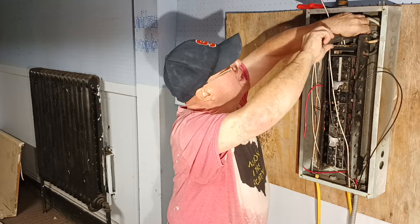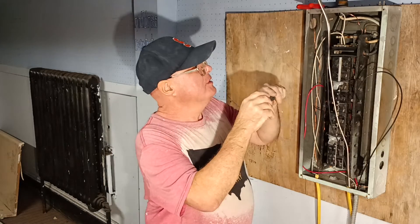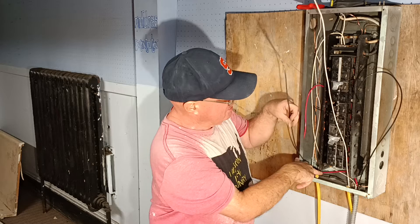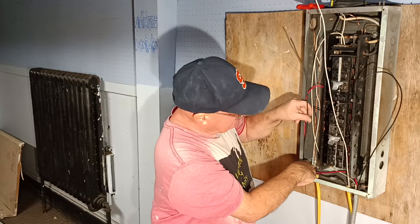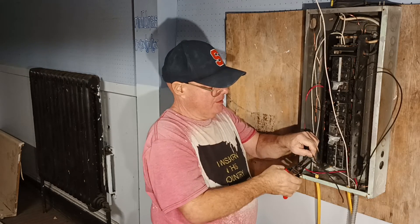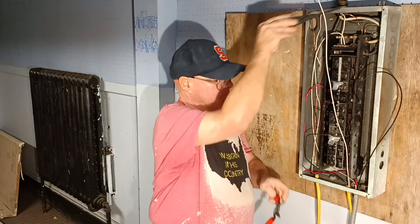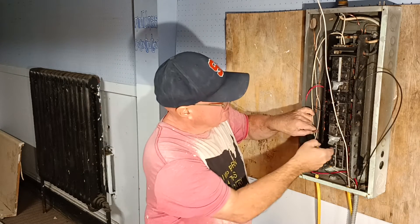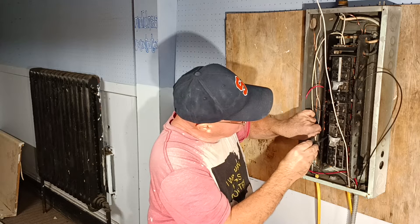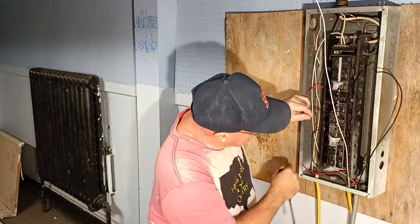Make sure the wire goes down through the hole all the way. This is the double pole breaker here. It doesn't matter which wire we put over there — we'll come down, come up, go all the way over the side, come up, come over, and cut it right here. See the tie between here? That's your double pole, and that's for your 220-240 volt circuit. We'll stick our wire under the screw and tighten it up.